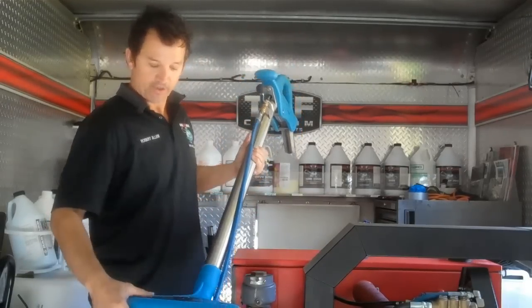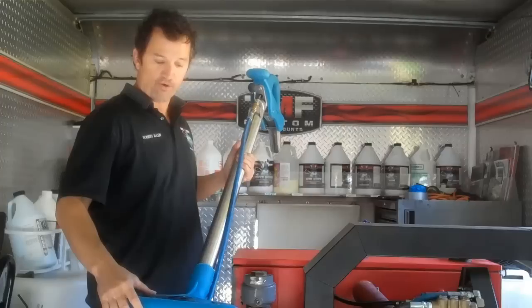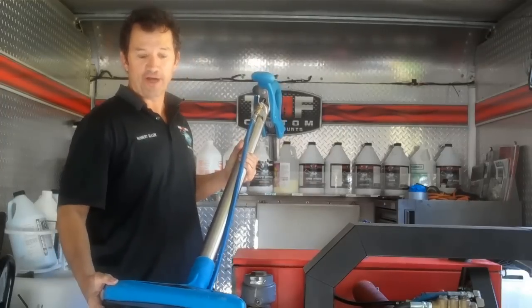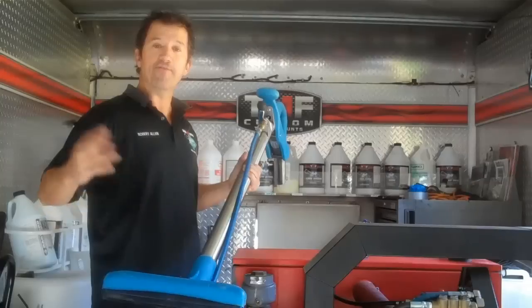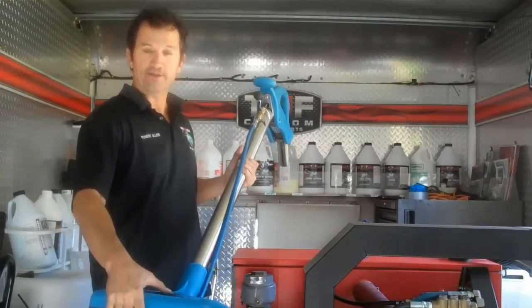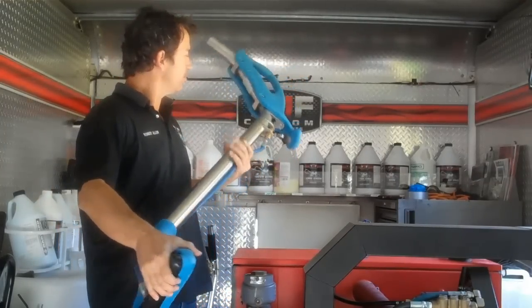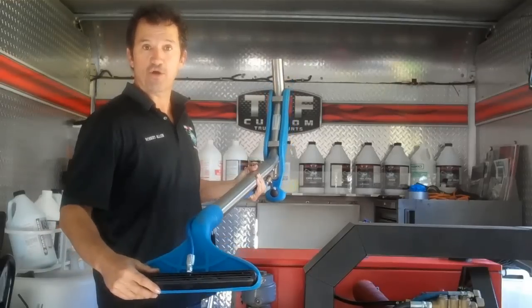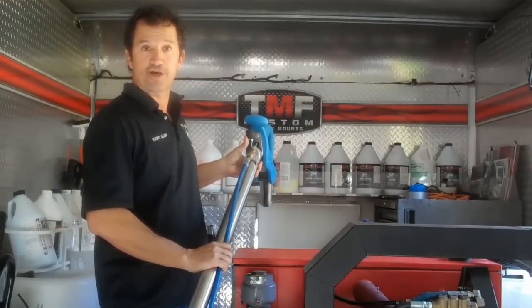The head is roto-molded and it's got a slide on it. We can adjust the vacuum back and forth in case it locks down on carpet. I've talked to a couple of owner operators who own this and they mentioned it has a tendency to lock down. They just adjust the vacuum outward and that makes a difference. They also said you can clean on the forward and reverse stroke, so you never have to cut off the ball valve unless you're just doing dry strokes.